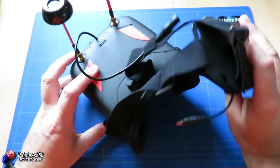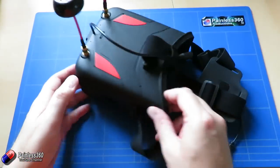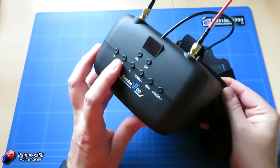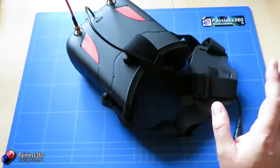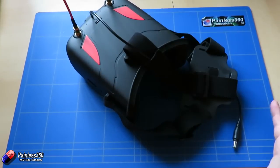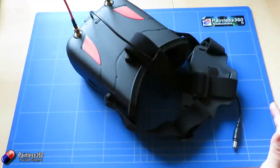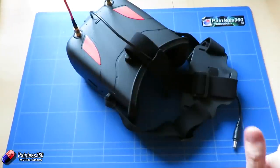You can set the DVR to HD mode, but there's absolutely no point. You access all the DVR menus by pressing and holding the square button while on AV2. I would only ever record in VGA mode — the screen is 800 by 480 anyway, and it only records at 640 by 480. Bumping up the DVR quality just consumes a lot more card space without any additional quality. My tip is to leave it on VGA: the card will last longer and you won't pay the penalty of extra processing in the goggles.